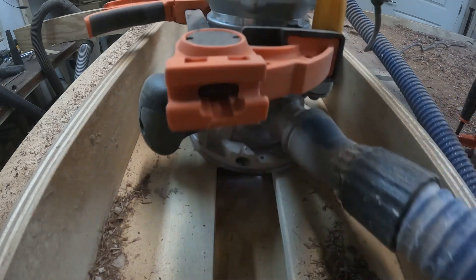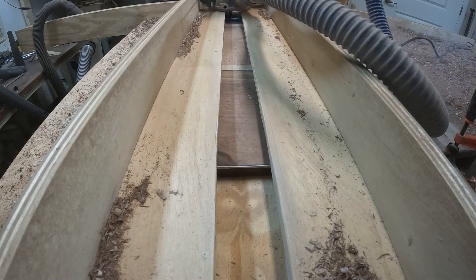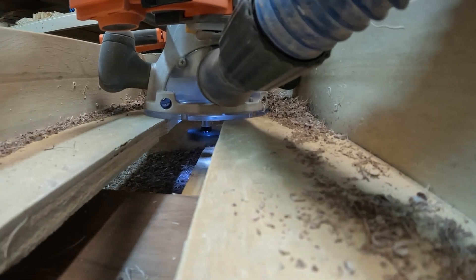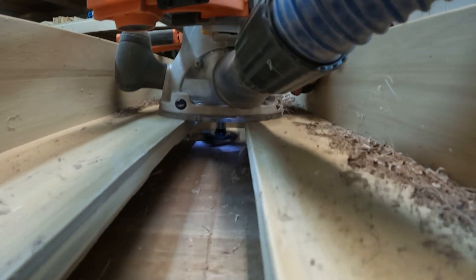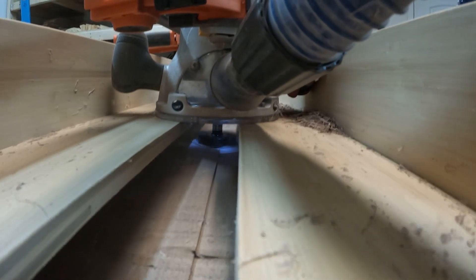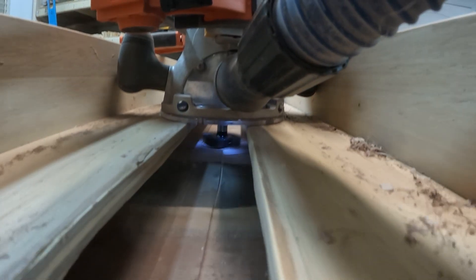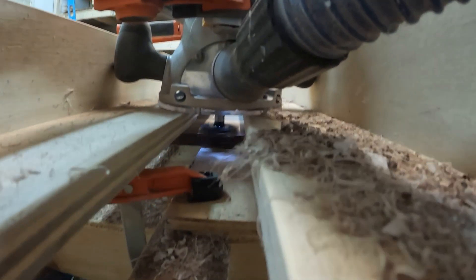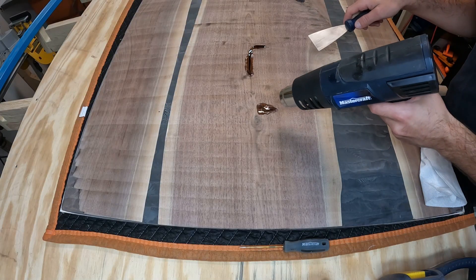One thing I found I wasn't too happy with: to have enough gap to flatten a two-inch or more slab, when you've got a thinner piece like this desktop you end up with a really big depth between the router and the material, so your bit isn't held super well — not a good idea. I ended up lifting the slab instead. After that I went back and did a little YouTubing to check what other folks are doing, and a couple of people have been using bit extenders.